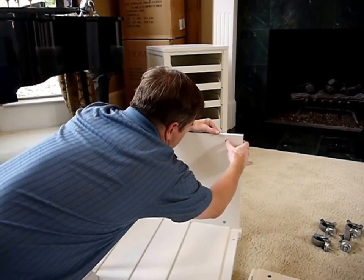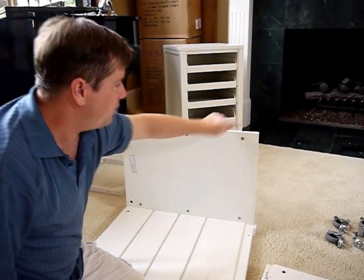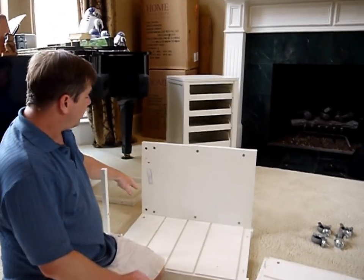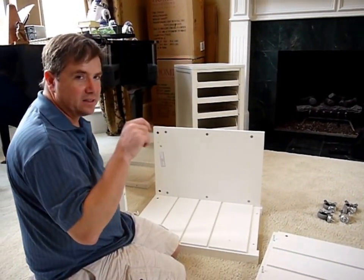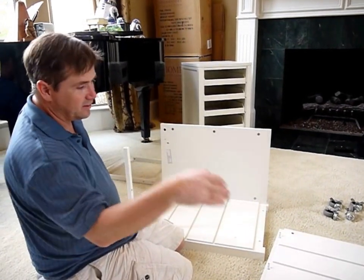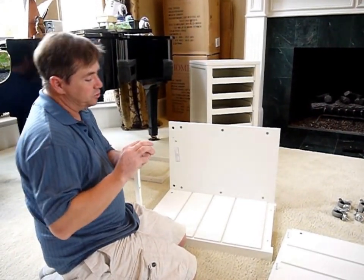When we assemble the top, what you'll find is these are nice because when you put them flush in, the jig was set up so that it's exactly the right depth when it's flush to the back wall surface. On the others, the walls are a lot thicker, and so the cams go down in, and you've got to find how deep to set them, so you actually just do it in reverse. You put the bolts in place first, and then you slide the cam over it using that handy-dandy arrow groove that will let you do that.